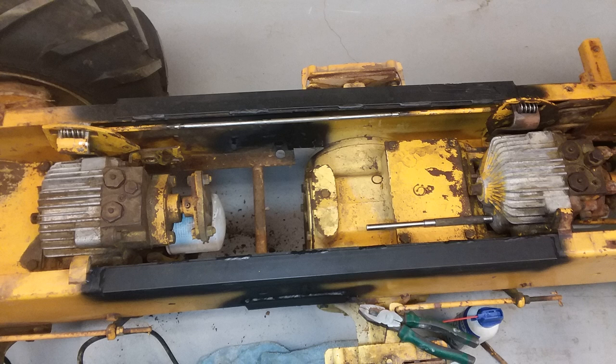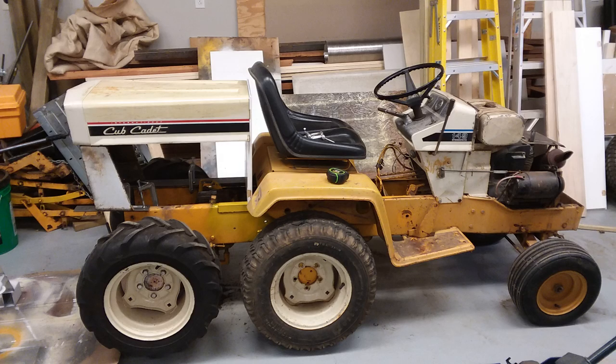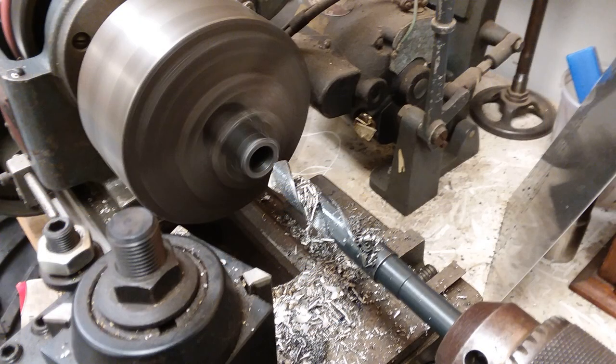Here you can see the two hydrostats — the one on the left and the one on the right — the finned aluminum housings — getting ready to connect them together with a common drive shaft. I didn't have any kind of written plans for this build; most of my work was through mock-ups and making adjustments as I went along. Here I'm just trying the engine hood and front grille on the back of the frame to see what it looks like. In order to build the connections between the two hydrostats I needed some couplings, so here I'm at the lathe boring out some one-inch round stock to make couplings for the five-eighths-inch drive shaft.